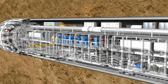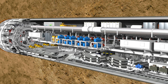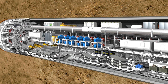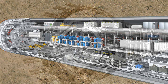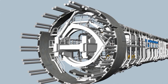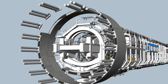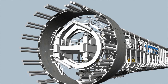In the front section of the backup, the lining segments are lifted individually by a special transfer crane, which lifts them onto the segment feeder that transports the elements to the front of the tunnel. Here, the heavy ring segments are picked up and positioned by a hydraulically controlled crane arm called the erector, using vacuum plates. The erector is installed on two rails and can be moved, rotated and telescoped.